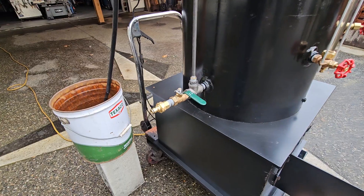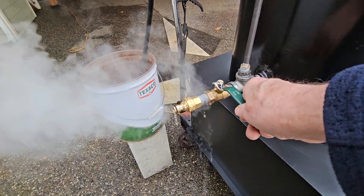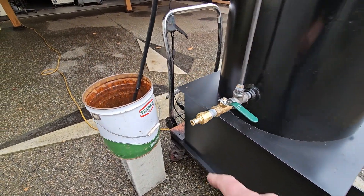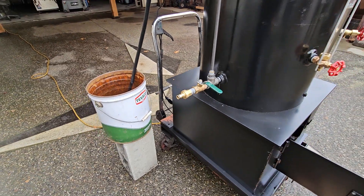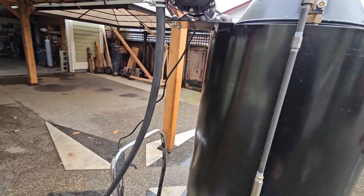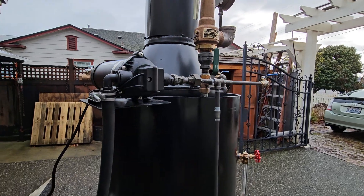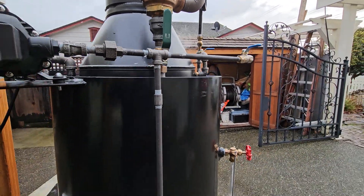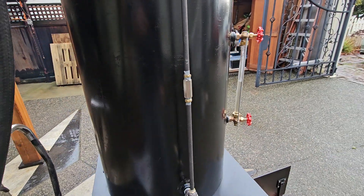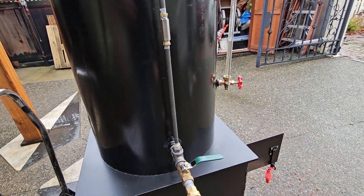Water fill and drain is right here. You can blow down the boiler right there if you so desire, and you can clip a hose on here and fill it. First thing you ever do to a boiler is always fill the water. I have a really nice water pump on it — it's AC. It has a bleeder valve right here, and of course a check valve right there. Everything that goes into the boiler stays in the boiler.